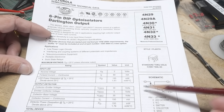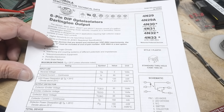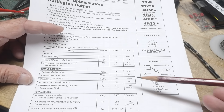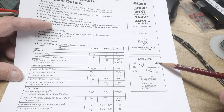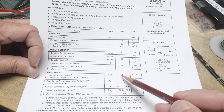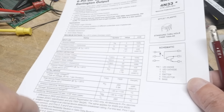So the LED can handle as much as 60 milliamps. Power dissipation is 120 milliwatts, so you can drive the little LED pretty hard. Collector-emitter voltage is 30 volts for the transistor, 150 milliamps current — you can see the Darlington. They bring out the base to pin 6, so we'll play with that later. Isolation from one side to the other is 7500 volts AC — isolation surge voltage.